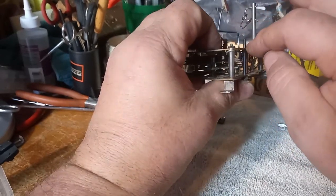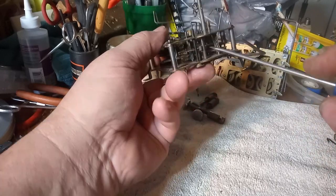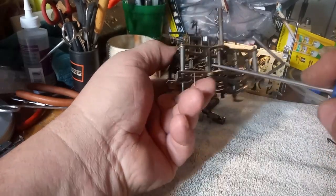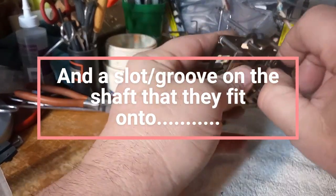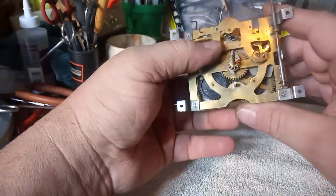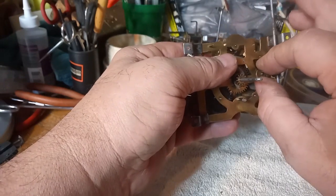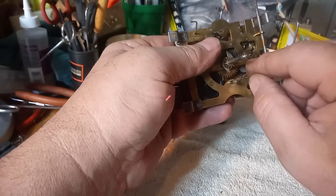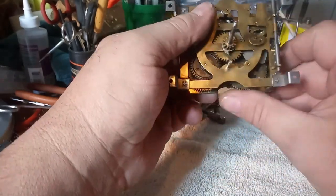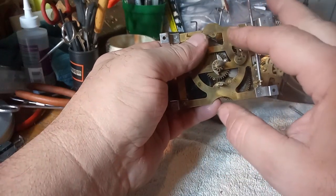I took the music lever off. Like I said, these things typically have clips on them. If they have a compression clip, it will be on the outside of the plate; if there's an E-clip, it will be on the inside of the front plate. Once you've got the clips off, you can take these off.